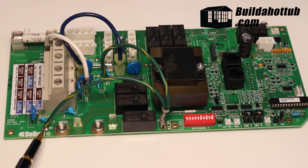All of the Balboa circuit boards have a Balboa logo, and somewhere on the board there is a model number and a part number. On this particular one I have a GS500Z — or GS500Z if you're in America — and a part number of 22015_B. This is a good starting point and a number I'm going to need to cross-reference.